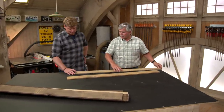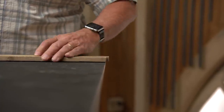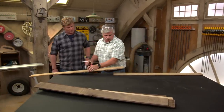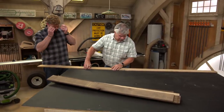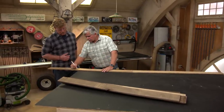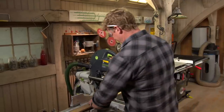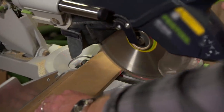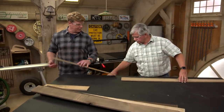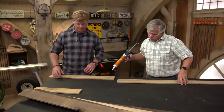The first thing we're going to do is start at the top and work our way down. I'll take this board and let it go past the edge so it'll be a little long, and I'm going to overhang it slightly at the top and mark the length for our first piece. I want to just see how the joint is here — I don't care if it's really square. I'm going to mark it long. You want the cut edge or the rough edge? Keep the cut edge. So now I'm just going to use some construction adhesive.